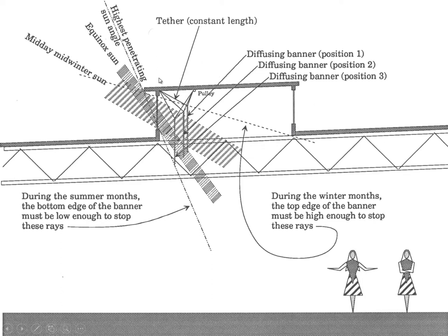In this case the monitor is resting on two key points in the truss. This is not the way you would normally do it. You'll notice that the top cord is actually passing through the space, so there's no decking on it to stabilize it laterally. Additional bracing is required to keep this top cord, which is in compression, from buckling to the side.